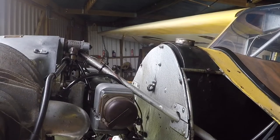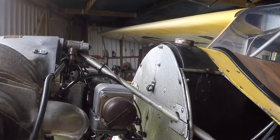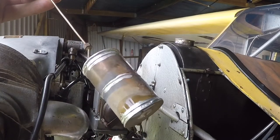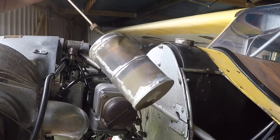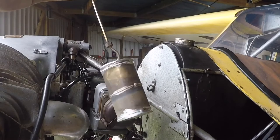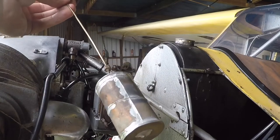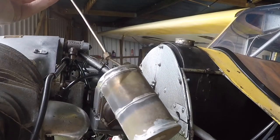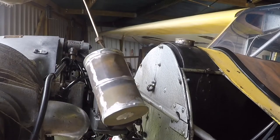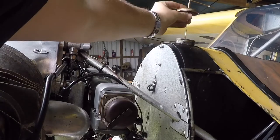That's about it — the fuel flow check was successful, and I've really just got to go around wire-locking everything. Just before we go though, I thought I'd show you the float — that's the float that goes in the fuel tank. Originally it had an epoxy-coated cork, but I don't like epoxy floating around in fuel tanks — it always goes funny, then goes all yellow and horrid. I made that out of shim material, just wrapped around a broomstick, wired up with copper wire, and the whole lot soldered together. You can do it with a blow lamp — don't need an oxyacetylene or anything. Very easy, just plumbing stuff — get shim off the internet, it works a treat.